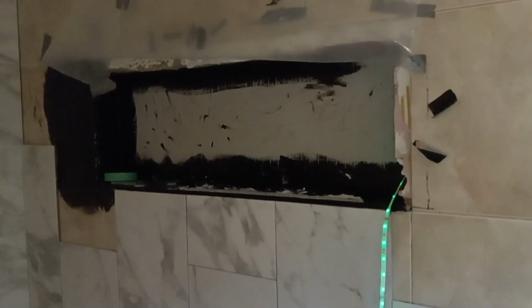All right, so here's what it looks like when it's dry the next day. It actually turns black from brown, and it creates basically this rubber coating across your surface, right? So definitely worked pretty good. Now again, if I was to be painting steps, I would definitely probably go and do another coat and put another layer of fiberglass if I had joints. Otherwise, this is pretty much ready.